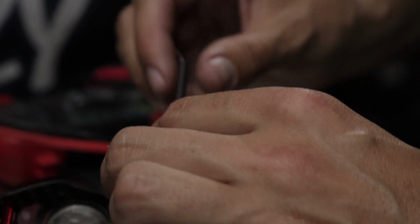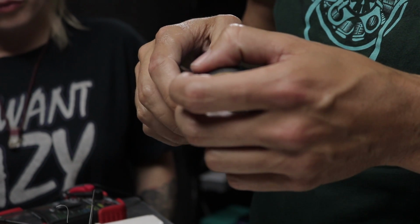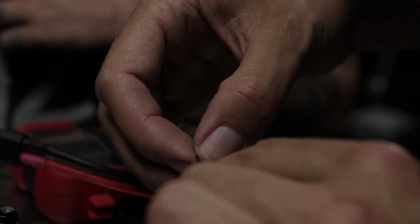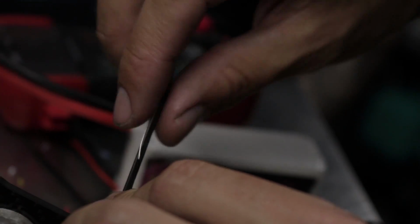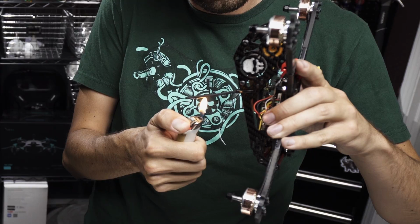We are going to cover the sensitive portion with that heat shrink so it's protected. Once the heat shrink is shrunk, it could still pull off, but something I've found that will make it much harder for the heat shrink to pull off is to take a little teeny piece of electrical tape and wrap it around the end portion here. That's going to reduce the chance of your antenna slipping relative to the zip tie. It's going to reduce the chance of your heat shrink coming off, because once it shrinks, it's going to grip the thickness of that tape.